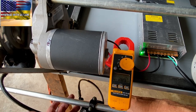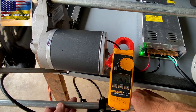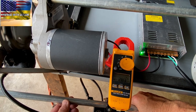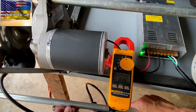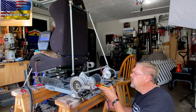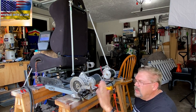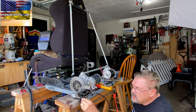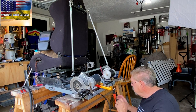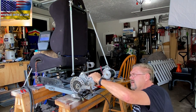It didn't trip it. So you don't want to do this more than a couple of times. We saw 15, 19 amps. So let's think about this — it's idling right around two and a half amps, and a little bit of the brake is actually hitting. I just kind of got this thing in place, so obviously it's not perfect. You wouldn't want to run your car like that. Let's shut this down. The motor's fine, the brake is fine — barely touched it.